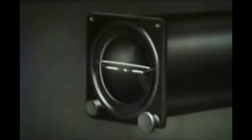It is unnecessary to cage the gyro in either instrument during any maneuvers. This miniature plane represents the aircraft, and this bar represents the horizon. The horizon bar is mechanically linked to a gyro mounted in the case. The two supporting arms are connected to pivots at the rear of the outer gimbal and by pins to the inner gimbal. When the aircraft climbs, the gyro remains erect while the aircraft and case move around it. This action lowers the horizon bar below the miniature plane.